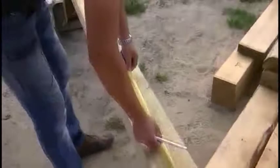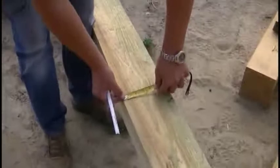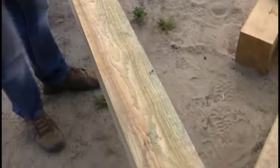And we are ready to move dimensions straight onto the beams. The timbers that we are going to use to build the jack rafters are more friendly than the ones used in the last chapter. The cross section of this is 8 by 18 cm, so they are relatively light, therefore the work will be much more comfortable than it was until now.